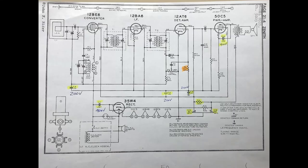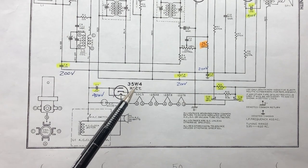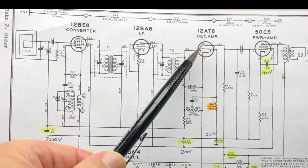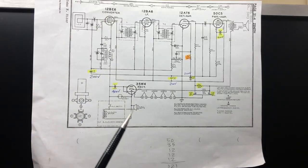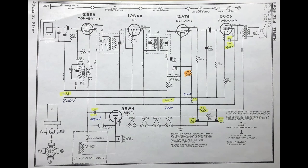A quick update: a couple of my subscribers brought to my attention that I might not need the diode because the tube voltage is close to 120. So I went back to look at the schematic and I see they're right. This is the first time I did not add the tubes — I was so involved in fixing this. The best way is to add the tubes. You see it's 35 volts, then 50, 12, 12, and 12 — if you add all together it's about 121 volts. My apology; I'm going to go back and remove that diode because this radio does not need it.